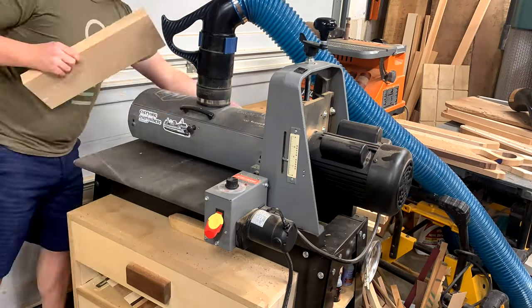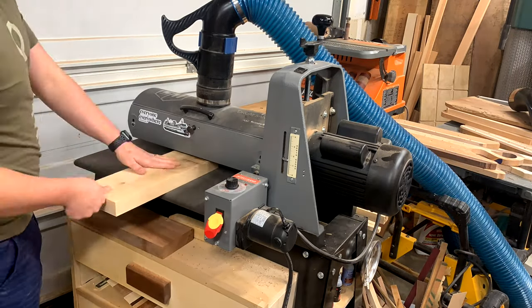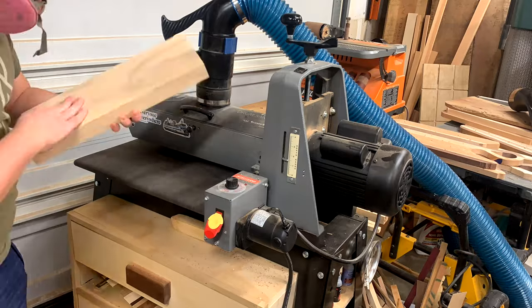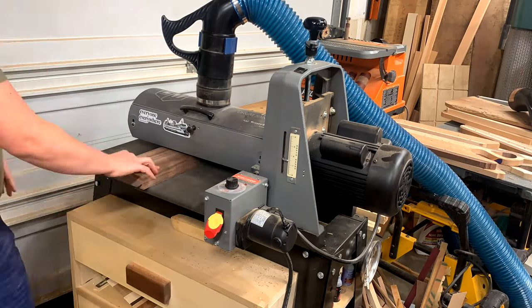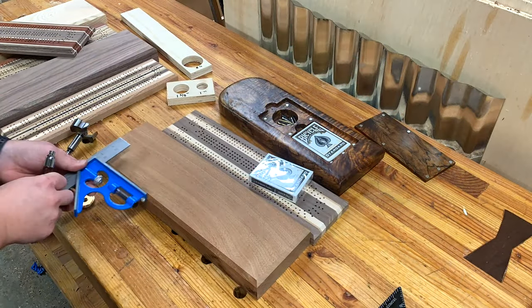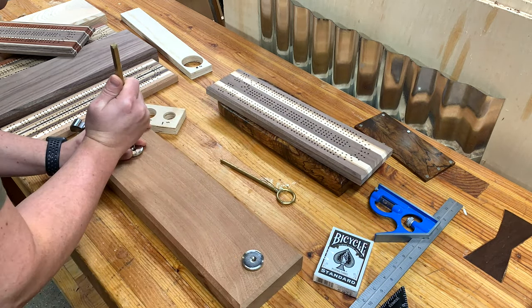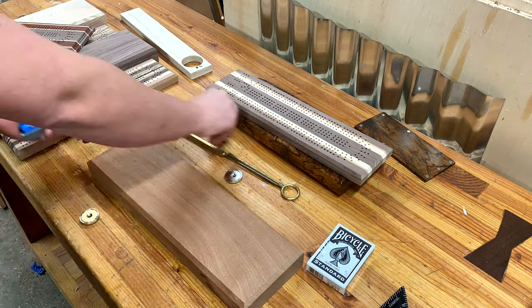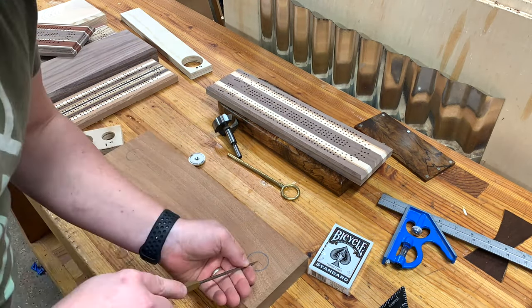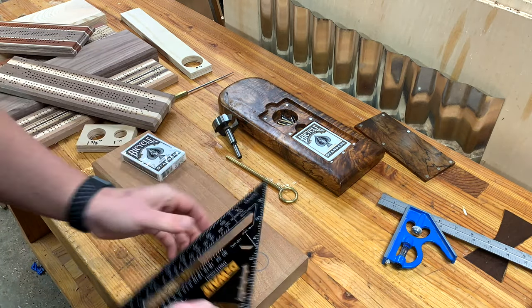For the bottom base, you want to make sure the piece is just a little bit wider and longer than the board, and about an inch and a half tall — not much bigger. These ones had to get re-sawn to get down to about an inch and a half. However you do that, get your piece milled up to the right dimensions, then mark it off. Get a center line for the board and trace out where you want your magnets. These are really nice heavy-duty magnets with a hole in them so I can center them off. I'm drawing rough holes — it just gives me a rough idea where everything is, so I know where my magnets are and where my card storage is.